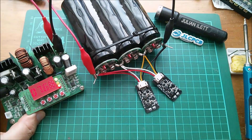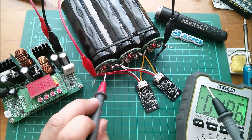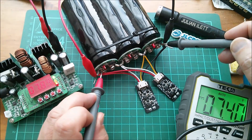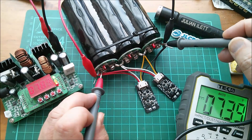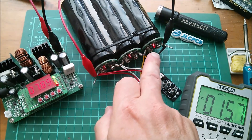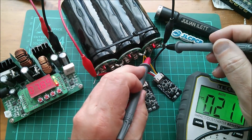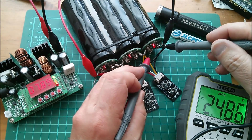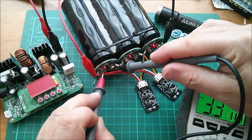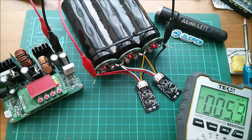All seems a bit dead. I've got 7.9 volts here so I got my DMM out. I've got a light coming on, but there's only 7.4 volts across the caps. However, one super cap LED is on so that one's going into over-voltage protection. Checking the individual cell voltages: the first is 2.48 V, the middle one 2.47 V, and this one 2.47 V. I don't quite understand why the active balancers haven't kicked in yet — they can probably be spurred into action with the light bulb.